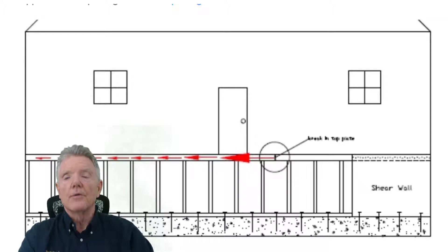A lot of times we don't have a choice about where we're going to put our shear walls. We come across a cripple wall and we'll find all kinds of pipes, gas meters, sections where the wall was just taken apart for whatever reason. So we don't have a lot of choice — sometimes we can put them on the end, sometimes in the middle. We just put them wherever we can possibly get them, and we never know for sure where that's going to be. And there's a problem with that.